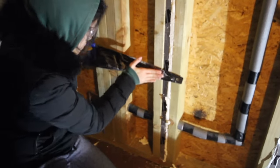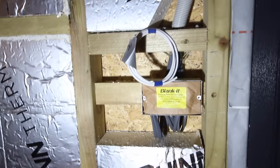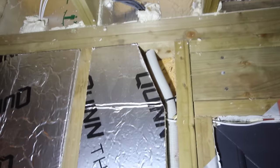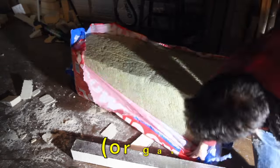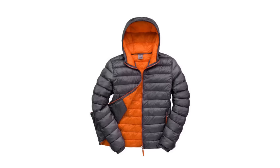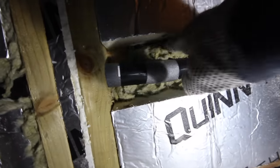So when that was all done, Abby and I went around the room and cut off any excess spray foam. The remaining areas to fill are around the pipes and cables. You could fill them with spray foam, but I was mindful of not surrounding cabling too tightly with insulation, even if it is in a conduit. So I instead decided to use thermal rock wool for these bits. With all insulation, it's actually the trapped air inside it that provides the thermal resistance — it works in the same way a puffer jacket does — so the trick is not to pack it in too tightly. I tore off small pieces and pushed them in gently until it was filled.